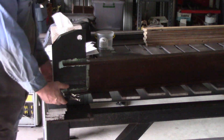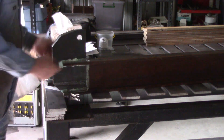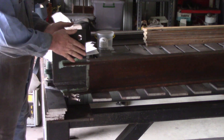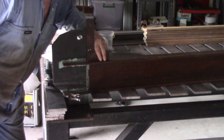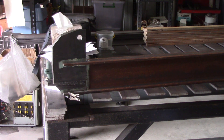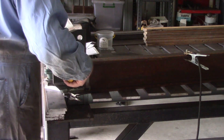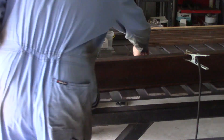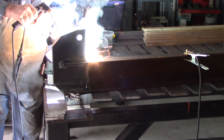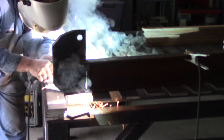I've got this set up in there now. I've clamped a piece of scrap iron across the bottom here so I can sit this down on it and it'll be flush with the bottom. I've prepped the sides where I'm going to weld to make sure I'm not welding through mill scale, because there'll be a lot of pressure on these welds. I've got it centred and squared up in all directions. I'm going to put some tacks on it now — going straight in with the 7024 rod. I don't want to risk welding that support piece to it, so I'll drop it off now.